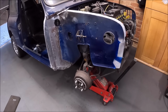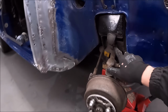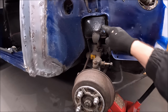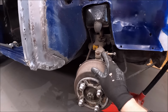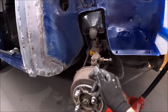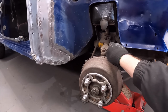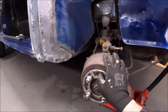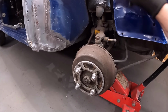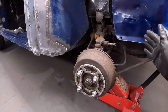I think I'm probably going to be doing a bit of mechanical next, so the front end will be ready to go back on, but I need to do the knuckles. I've got some rubber donuts which I think are better than the ones in there. They're the rear rubber donuts off TARDIS, and the rear ones generally don't squash down as much, and TARDIS was very low mileage, so I'm going to repurpose those. I think I was going to buy high lows for the front, but by the time it's posted, it's an extra 45 quid on the budget. Donuts, knuckles, swivels top and bottom, brake hoses, do the same on both sides, then the front end should be ready to go on.